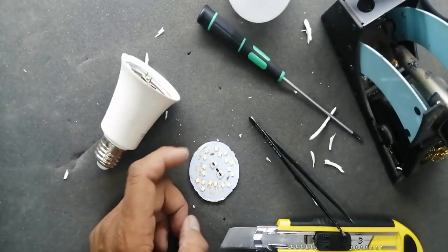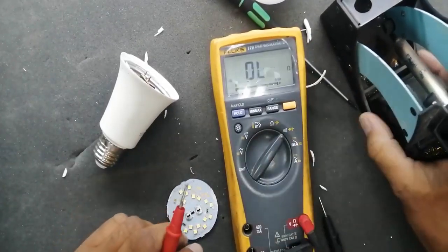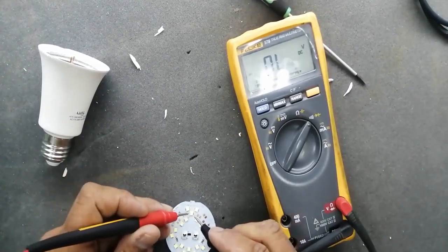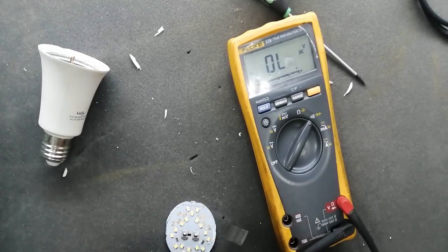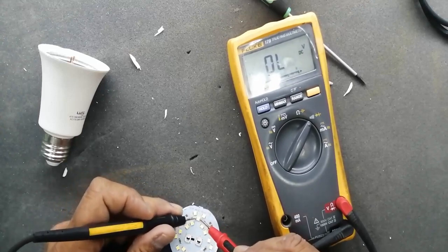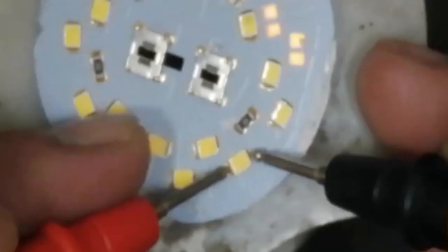This is the LED panel — there are LEDs in series. How we can test: first of all I will demonstrate cold testing, that is testing without voltage. The next step I will apply power and show you how to troubleshoot. First of all connect the multimeter and set it to continuity or diode mode, then apply the probes to the LEDs.